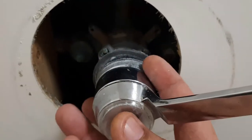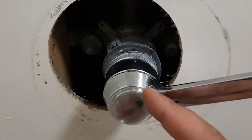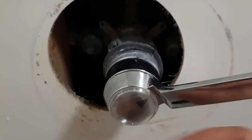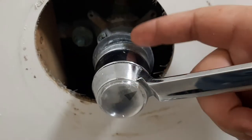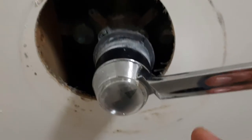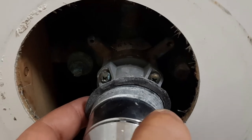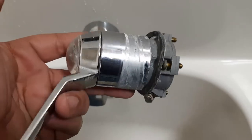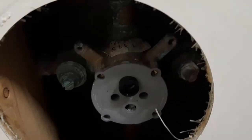I'm going to pull these four screws off and then this whole cartridge will pull out. Since we're not replacing the front cartridge, I won't have to remove the screw in here — sometimes this can be a pain getting the front piece disconnected from the cartridge itself, so we're just going to leave that. We got these screws loose, so now just pull this straight out.